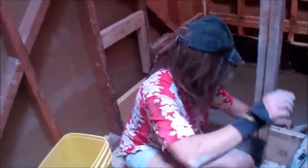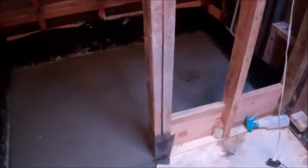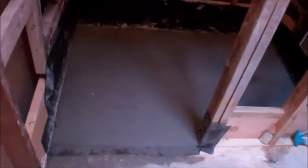That's the way the cookie crumbles today, ladies and gentlemen. It is five o'clock and Rosie has done an amazing job getting the mortar bed in. You can see where the drain is over there, and she made sure she's got a downward slope towards the drain from all angles using the level. She did an outstanding job here.